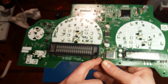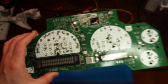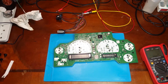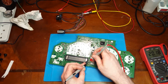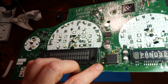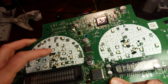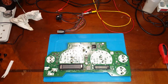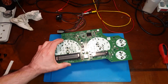I'm going to double-check that gate resistor for sure. There's another ball of solder on the diode. Being that this MOSFET is blown, it doesn't matter how well you reflow it — it's not going to work. The resistor I'm checking should be 100 ohms; this is the resistor that feeds the gate of the MOSFET and it usually takes abuse when things go bad. It's reading 20k — it's supposed to be 100 ohms — and it's fried. So the resistor blew up from either the MOSFET blowing or the ball of solder. It's possible this fed back into the driver chip, but we'll replace these two parts and see. When these MOSFETs get hot they kind of weld themselves to the foil, so I'm expecting a fight getting this one off.